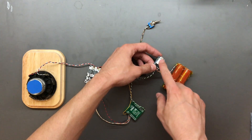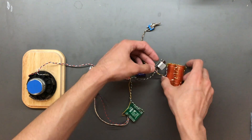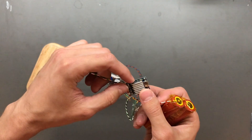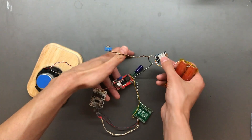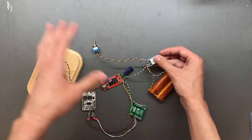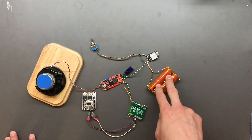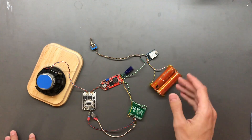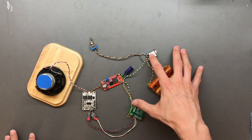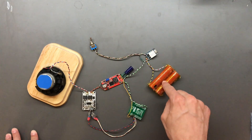Mine has a little heat sink epoxied on top — I'm pretty sure it doesn't add much but it looks cool. I've added a resistor of around 500 ohms on the SET pin, removing the original 1.2K that was there. This should increase the current up to about 1.7 amps — it never actually goes that high because it enters thermal protection, but it does charge quicker. Without the mod it would charge the 2P pack at about 600–800 milliamps, which is 400 milliamps per cell. These cells are around 2000mAh each, so it would take quite a long time. Now it's around 1.2 amps.